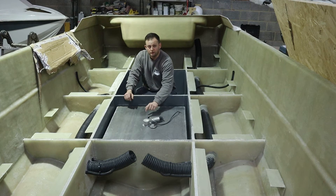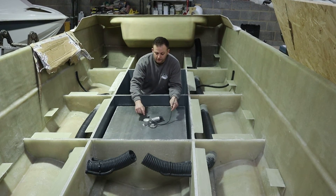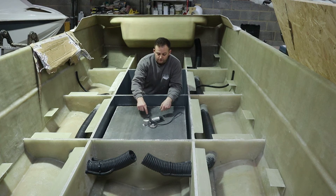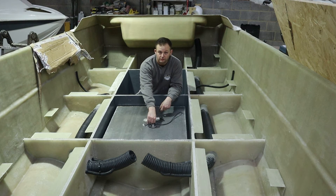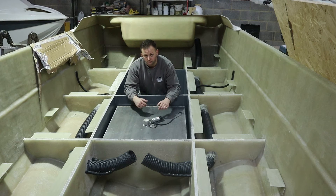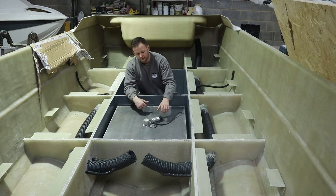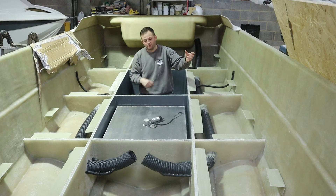Here we've got a 200-litre custom aluminium tank — six-millimetre plate. We've got our sender unit installed, and our feed and air on this side: one pipe for fuel going to the engine, and one for the breather which runs up to the filler cap in the leaning post, so when it's filled the air release comes out of the cap and the gunnel — all fumes kept outside the boat. Then there's a relatively large filler neck that'll come up to here, not a swan neck.